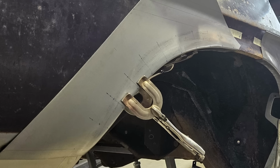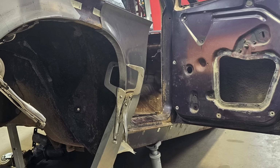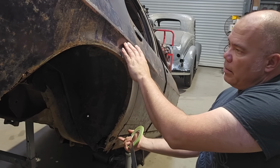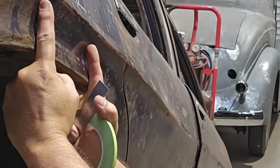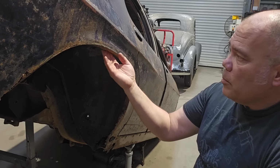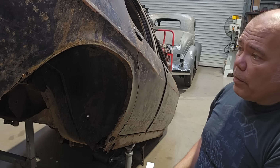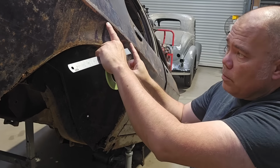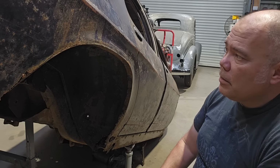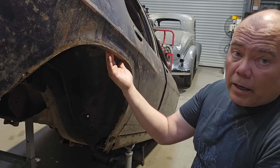Basically a fairly large rear section and then a very similar front section. And the larger I can make those, the better, because we'll bridge it with a smaller piece in the middle. So we're trying to do it in the most cost-effective way that we can. So for the sake of ending up with a 3-piece which has 2 pretty basic welds joining them together, turning it into one piece, that's my logic, and that's how we're going to build these wheel arches.